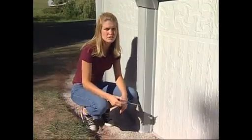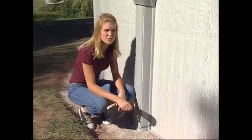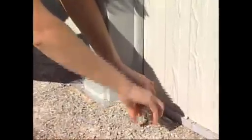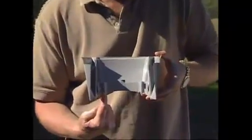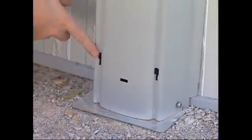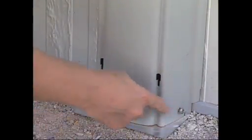To install the foot covers, use a screwdriver to loosen the 2 self-tapping screws at the bottom of each vertical by 2 full turns. Now, if you look inside the foot cover, you'll see 2 corner hooks here and here, and a center tab here. You'll also see 2 long side tabs. The corner hooks and center tab have to lock into these 2 notches and the rectangular slot in the vertical column. The long side tabs hook over the screws.